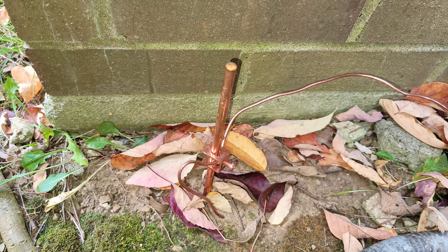The electric company put a new 200-amp service in for us. Guess what they grounded their equipment with? 8-gauge copper. So it's not that it can't work. Get your stuff grounded, make sure you have some surge arresters in line, and your equipment will last you a long, long time.